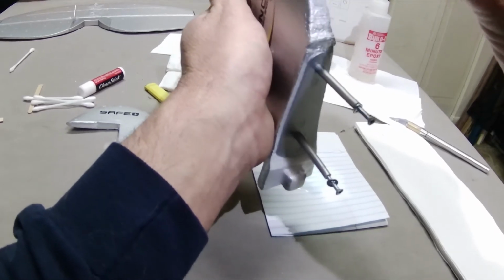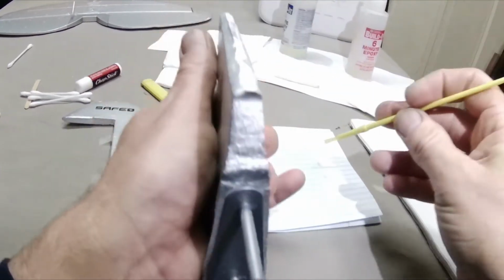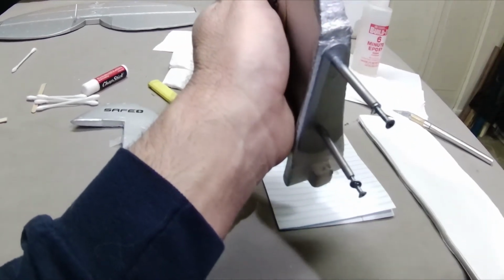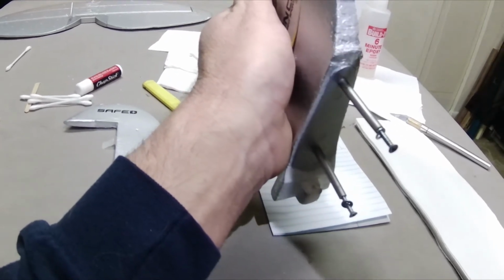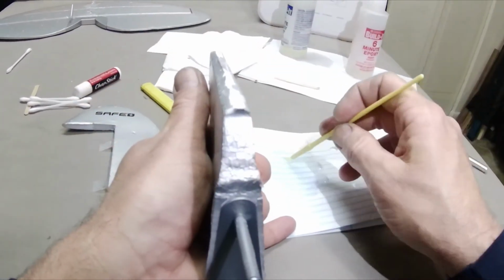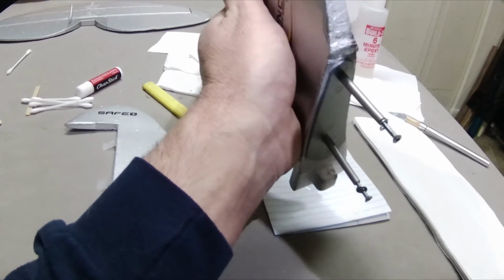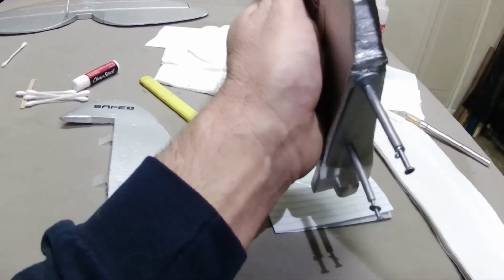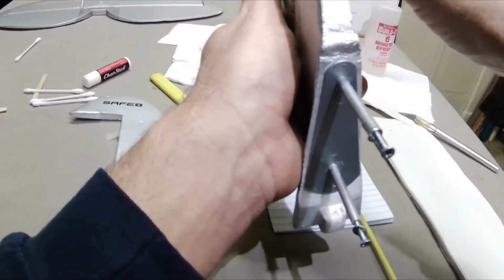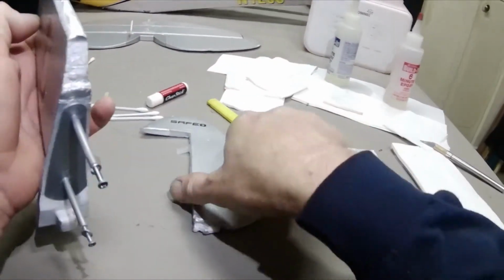The outside of the bottle might feel hot and the epoxy itself might be cool on the inside, especially if it's a full bottle. I've done it before where I've put this in a syringe. My pharmacy will give me some, no needle, just a syringe. 6 minute epoxy wouldn't work, but you get some 30 minute or 1 hour and mix it up on a piece of paper, then fold it basically like a funnel and let it run into a syringe. And then you can really guide it into where you need to go.